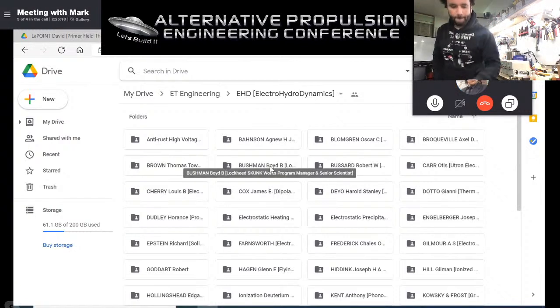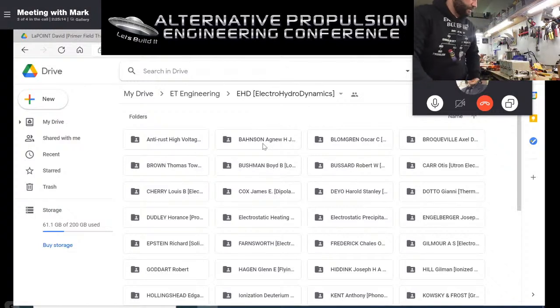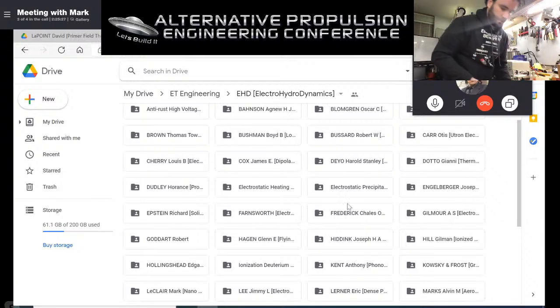I did look into GANFETs. GANFETs are amazing. They are very strange in the mounting packages. I don't particularly like the fact that you have 20 different individual points that you have to attach and route your PCB for. That's my only downside to actually implementing them and using them in future circuits: their mounting packages are incredibly strange, very small.